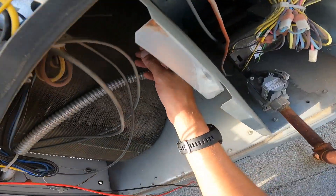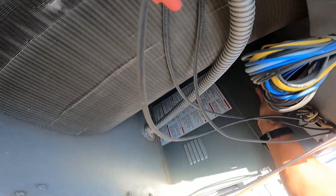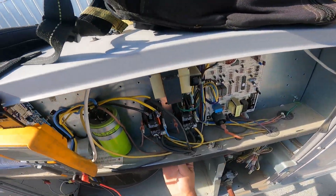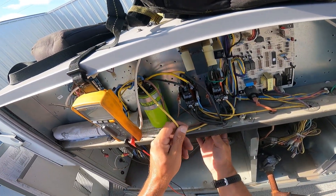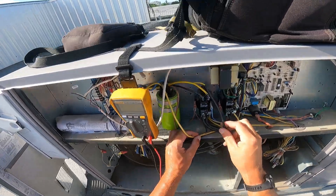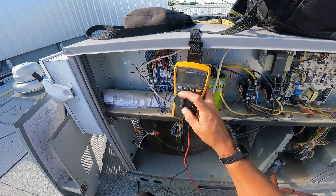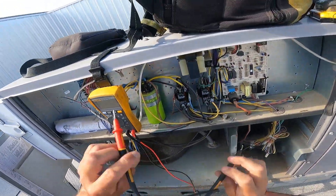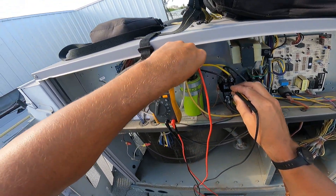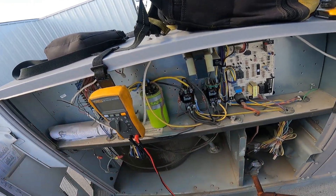Where are my fan wires? There's these guys right here. I'm going to check from my common on the volt with the wavy line, check on our common to here. 245. Okay, 245 - she's getting full voltage.